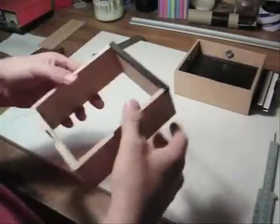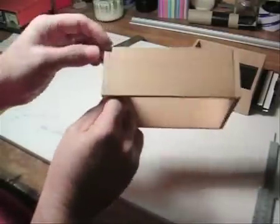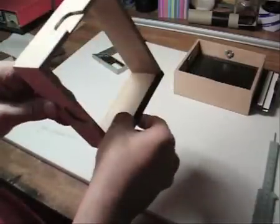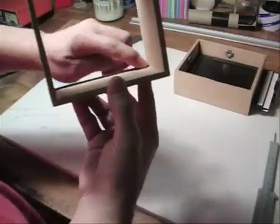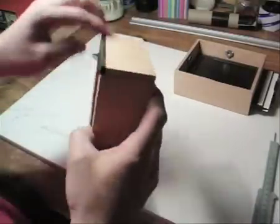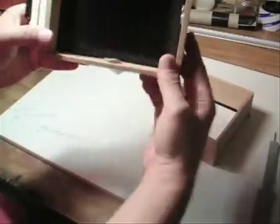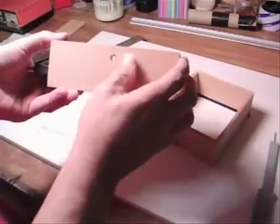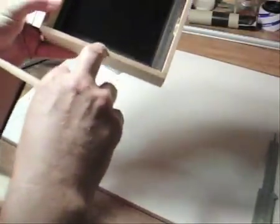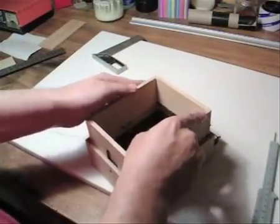So this is the stage we're up to at the moment. We've got the inbox — the inside of the camera built now — and we have the rubber piece here glued on the end, just a notch down, overlapping the wood slightly so it's not dead square but just overlapping inside the camera to give it a little bit extra width. I've routed these two sections out here and this will fit on top of the tripod mounts. These are put into the wood flush to the bottom with some glue underneath to make sure they won't move — they're actually hammered in, with spikes to hammer into the wood. So we're up to the stage where we need to glue this piece into the body of the camera.